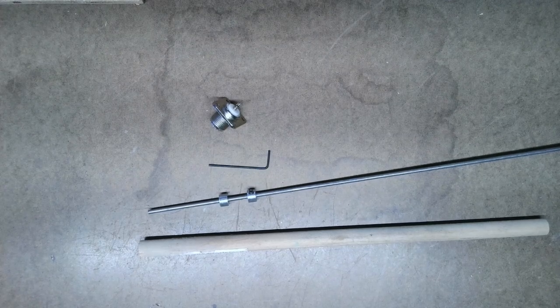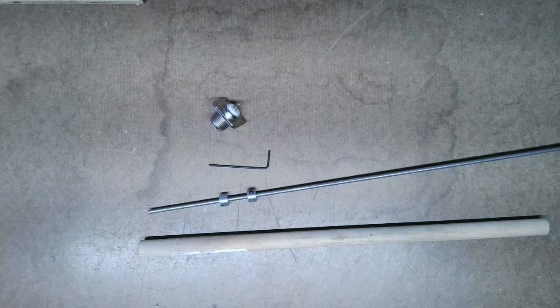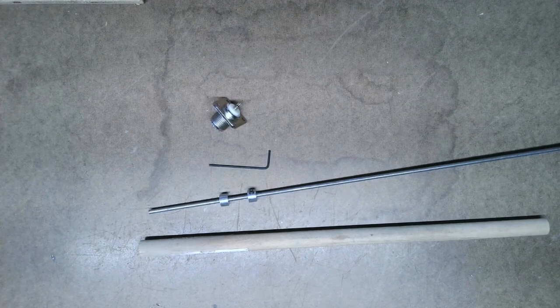Hello YouTube, I'm doing a quick video here today. I'm starting a video series — this is going to be part one of my adjustable J-pole antenna. Normally when you do a J-pole, you punch in the frequency you want, cut the wire to that particular length, solder on the feed wire, and it should be pretty decent for SWR. Well, I was going to build that and started to gather the materials when it dawned on me: can I make it adjustable?